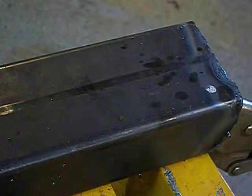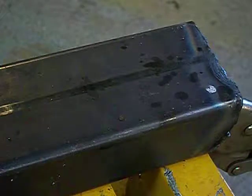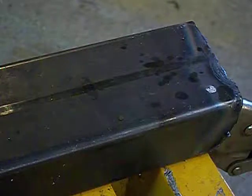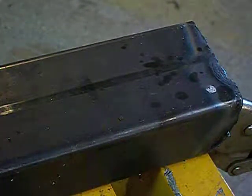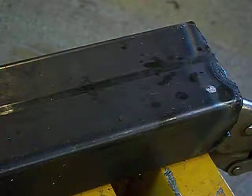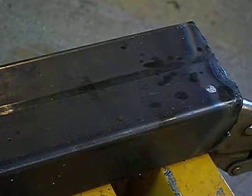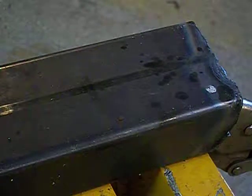Hey everybody, this is Eric from the Commodore 129 channel. I've been working on a 6-foot by 12-foot trailer, and I just wanted to show you how to set up and adjust the torch to do some cutting. I already set my regulators to 5 and 20. I'm using a Victor Super Range torch and I've got my valve set up. Regulators are configured the way they should be, and here we'll do some cutting.